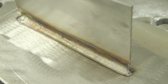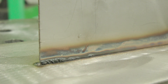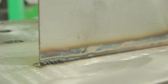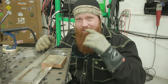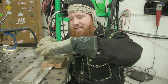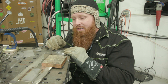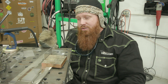So you can see right here on the back I got a small amount of sugaring — not proud of it, but I want to show you guys that it happens. One thing I could have done to prevent that: get a piece of copper and put it up against the back. That way, if there's any excess heat or the angle is off just a little bit, as long as you get it in there nice and tight to keep the air out, that copper backing is going to prevent sugaring on the back because there's no air in there, and it's also going to start pulling that heat out.